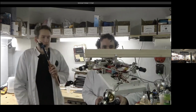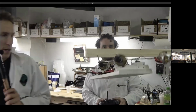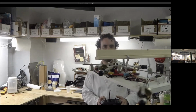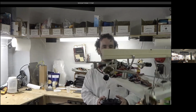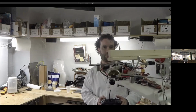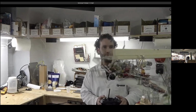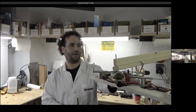Yeah, I can see a lot of instability in those motor mounts and the servo mounts. Oh, that was a little hyperextended there. You got some collision going on there. A lot of shaking going on here. Again, we need to eliminate that static friction point to make sure it's not just pushing off of that as a pivot point. Any place in the system where you can have a buildup of static friction, and then a sudden release of static friction, will create a push point where you can push off. Stabilize it a little bit.